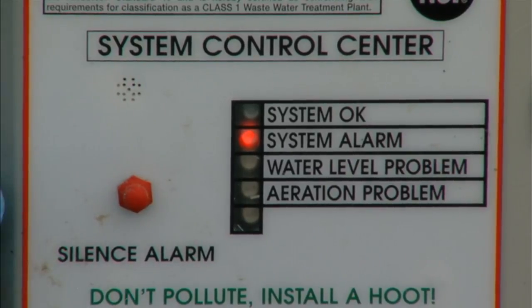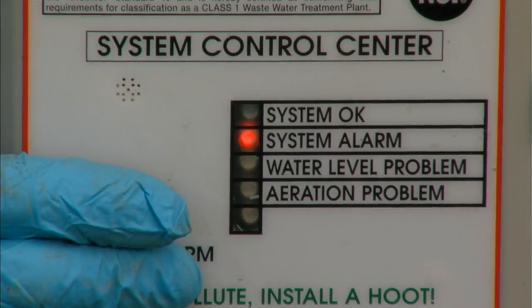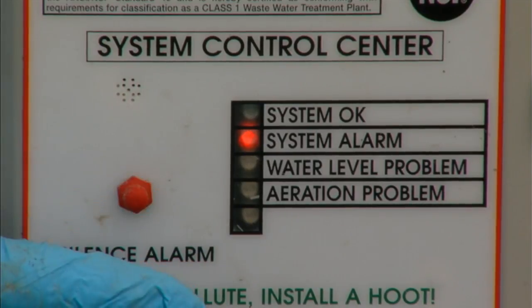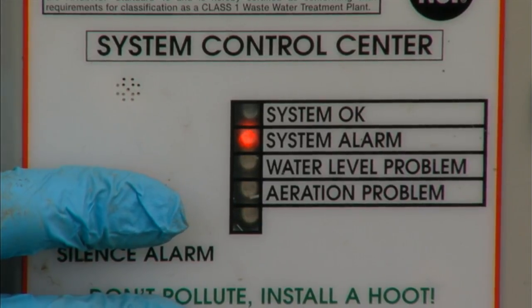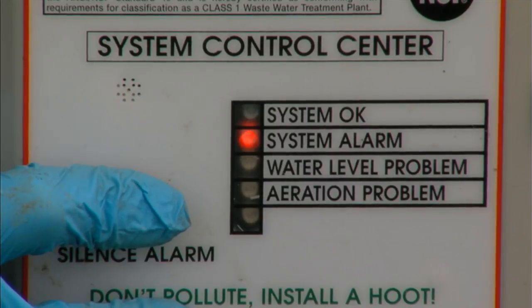When you're done checking water pressure, push the button again to exit mode 2 and go to mode 3. We press and hold, get our double beep to exit, release, hold back down, and the system goes through the lamp test with an 8-second delay past mode 1, mode 2, and now we're into mode 3.